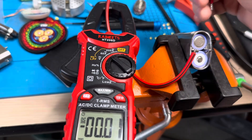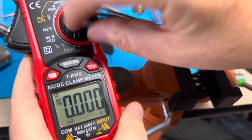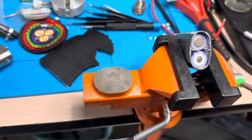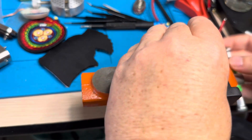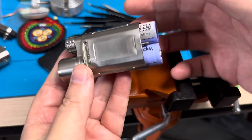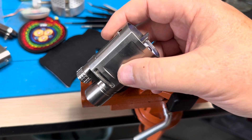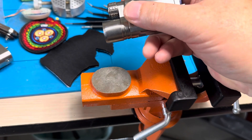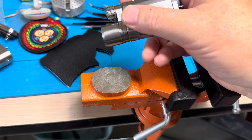If you're doing this with the clamp meter on a regular single battery light, you can just basically read it straight away. I complicated it by using a light with batteries in series. If it's in parallel, that also acts as a single cell. I hope you enjoyed this video — go ahead and measure the amperage on your own flashlight. Peace.